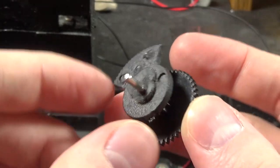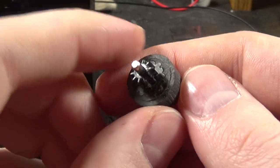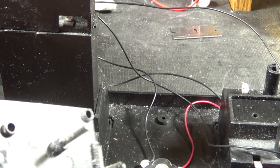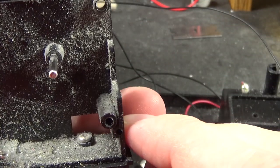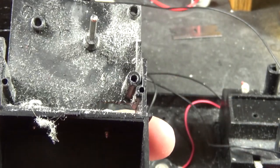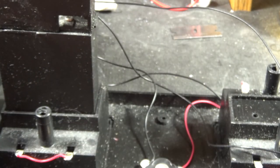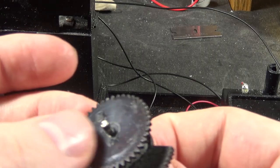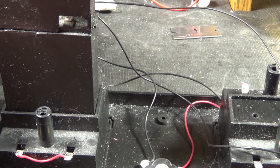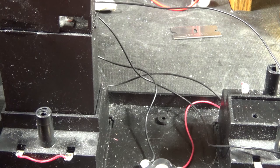This is all one piece — the gear in the front and the card gripper. That actually separates off, although the rubber bit is stationary, but you probably could still resurface it to some extent. The special gear is just free and its post is permanently mounted in the center. You'd basically have to clean out all the dust bits in here. If you were having trouble spinning, you could probably put the lightest amount of some sort of grease in there, being very certain not to get any on the rubber. There used to be grease and it's pretty much gone now — you could add a tiny bit back so it doesn't rub on the plastic so hard.